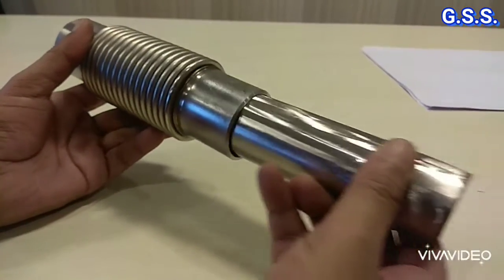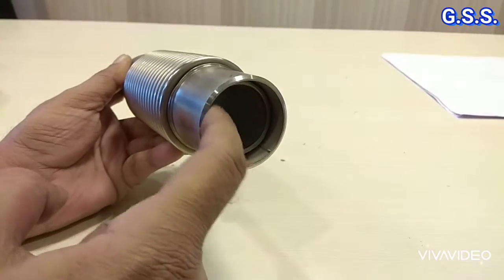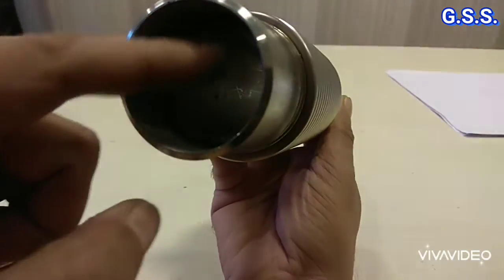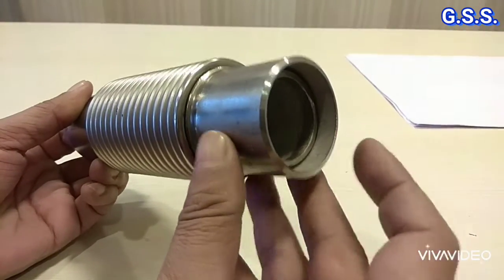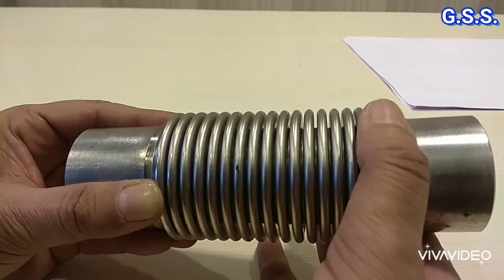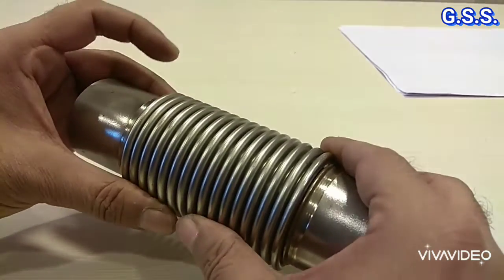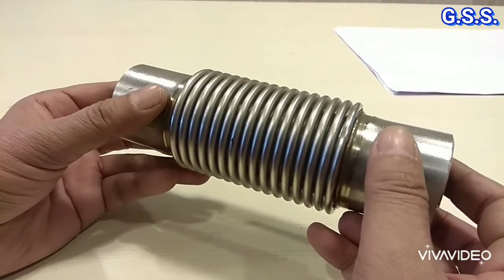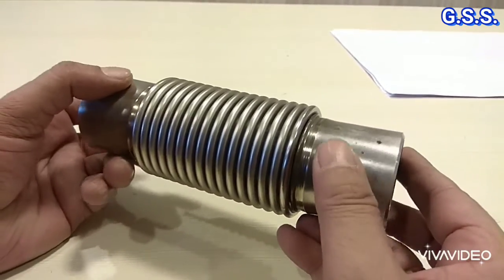This pipe piece will be placed inside the bellows and welded inside the bellows sleeve on one side. On the other side, the pipe piece will not be welded — it will remain as it is. The flow will be from one side to the other. Since this rigid pipe is there inside, the bellows will be able to axially compress and axially expand, but it cannot bend and there will be no lateral movement. In all other directions the bellows will be rigid; only in the axial direction will it be flexible. So the bellows will be safe for use as an axial bellows.